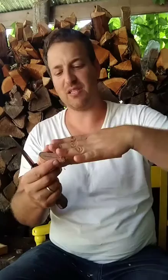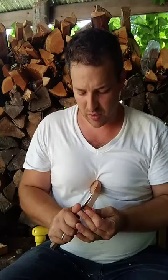I want this cut to flow all the way from the tip of the handle down to the spoon bowl, able to be cut in one direction. If I've leaned it down into the wood sufficiently, I can do a whole bunch of curvature without having to change the direction of my knife. But if it was a very shallow cut into the wood, that limits the amount of curvature I can do.